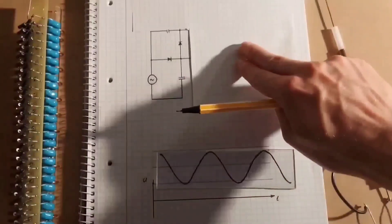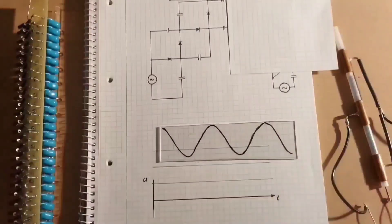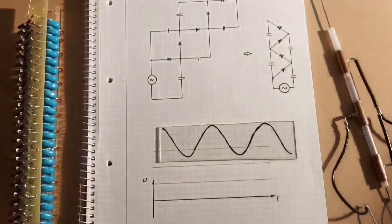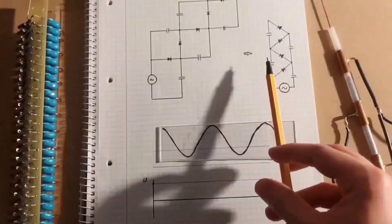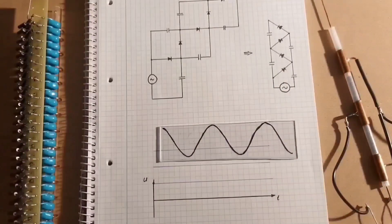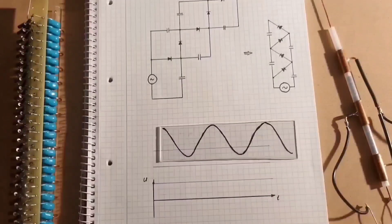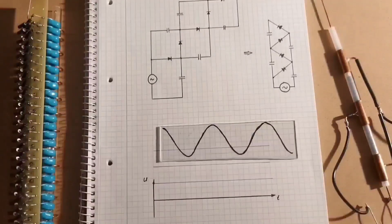This can be rectified again with another rectifier, and the voltage at this diode is again twice the voltage. This lifts it up, and this can be rectified again and again — so you lift it up and up. Now, every cap and every diode needs to withstand the peak-to-peak value, which is twice the peak value. Otherwise your caps will get overvoltage and probably break. The diodes will probably break due to overcurrent, which means you can't just arc around without a protective resistor.